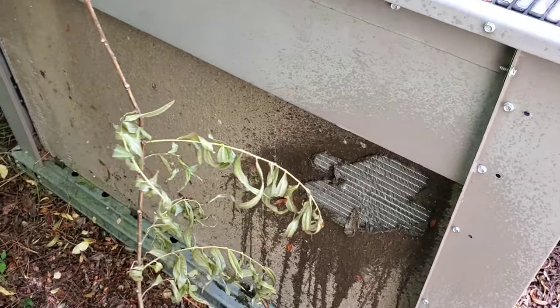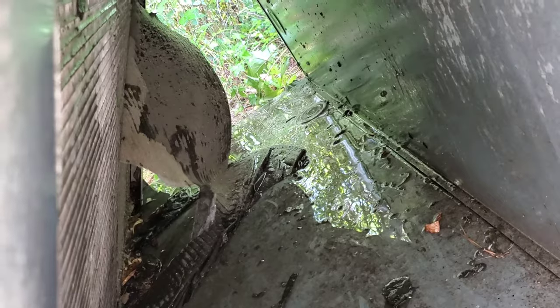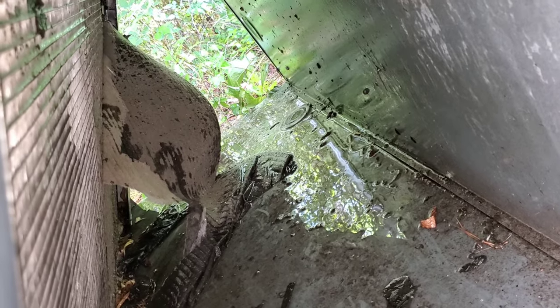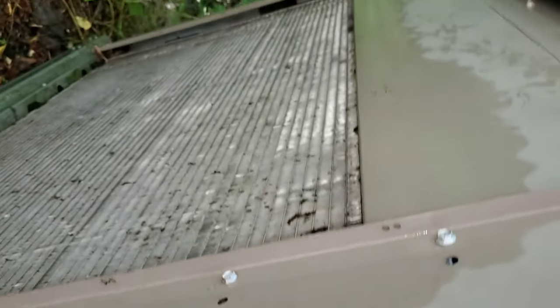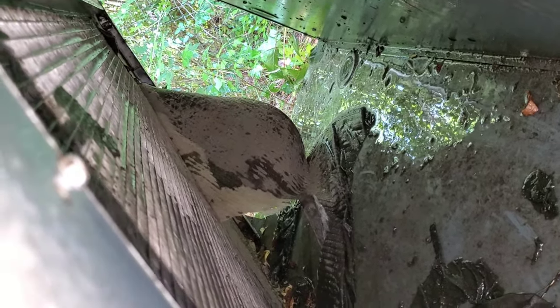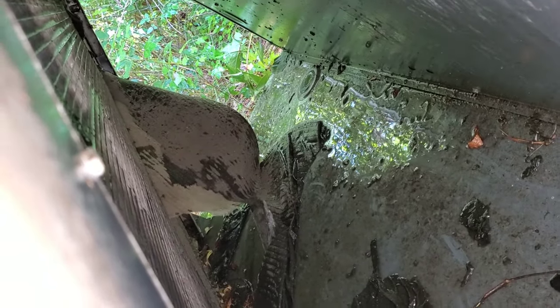Get them all cleaned and then we'll start up and start troubleshooting. I'll do another little clip of how it looks when I'm done. As you see, it's coming off like a blanket — which is not a bad thing, because this could have actually saved us. Hopefully the micro-channels aren't completely plugged and this was basically like a filter of dirt. They're not going to be absolutely perfect because there's a certain amount of time I get on some of these jobs with these chain stores.